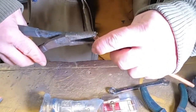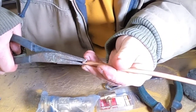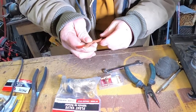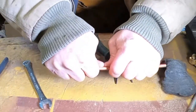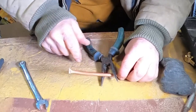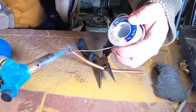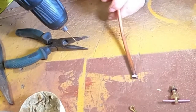Then I'm gonna take my pliers and pinch that shut, then fold it over. If you're gonna do some soldering, I recommend you wear gloves — not like me. This scar on my hand came from getting touched up against the torch when it was still warm. We've got that folded over. I want to solder this end shut. Be careful with your copper tubing not to bend it too tight because it will collapse on you if you don't have the spring tool for bending copper tubing. We'll solder that up — looks pretty good.